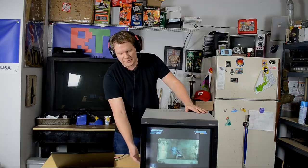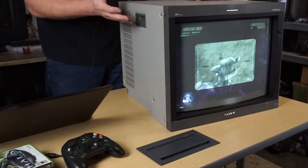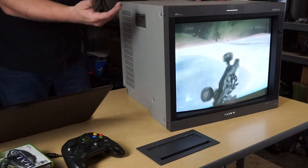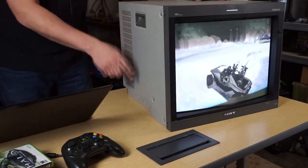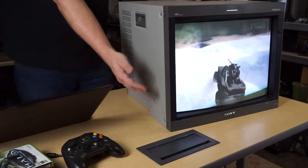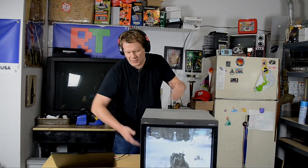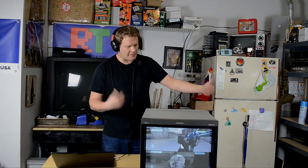That one's actually built into the bottom of this monitor, which is not a great design anyway. That's more of just a test speaker. The monitor actually points directly down, so if you don't have any extended or extension feet on the bottom of the CRT, then you won't actually get a good sound at all from this single speaker because it's just bouncing back into itself and coming back out the sides.